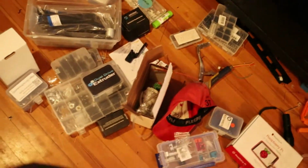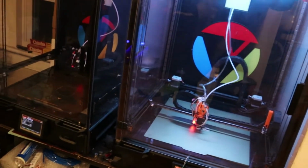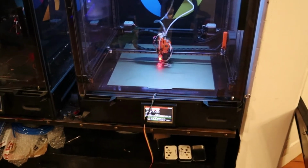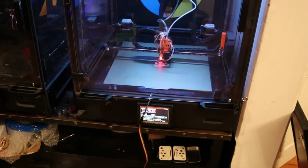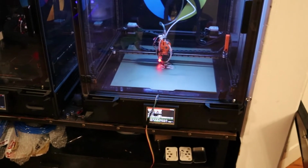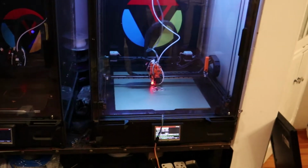So otherwise people complain that they can't turn the pump off. But I can run down to, I have it set to turn on at 30%. If I go lower than that, it sounds squeaky. It still works down to like 20 or 22, I think. It turns on somewhere between like 19 or 22, 23 when I tested it, but it wasn't consistent, so I have it set for a minimum speed of 30, this way it doesn't sound squeaky and annoying.